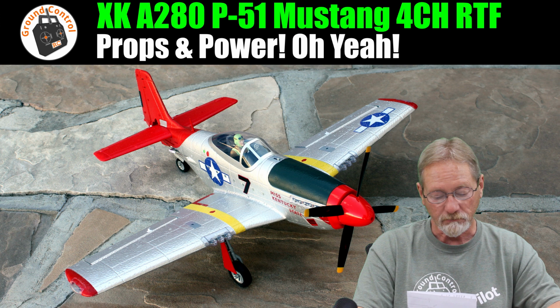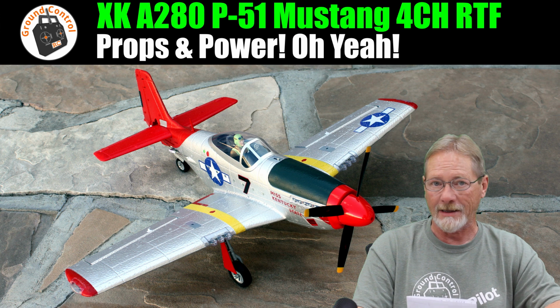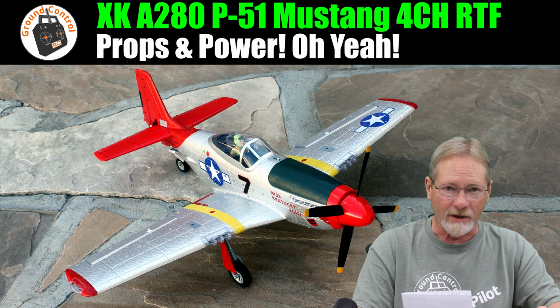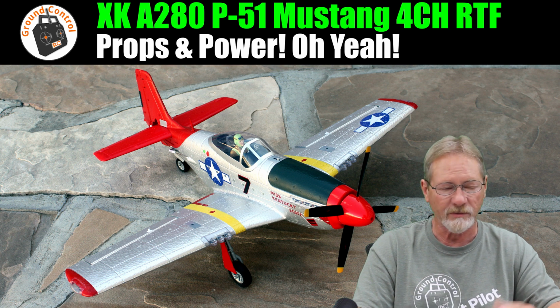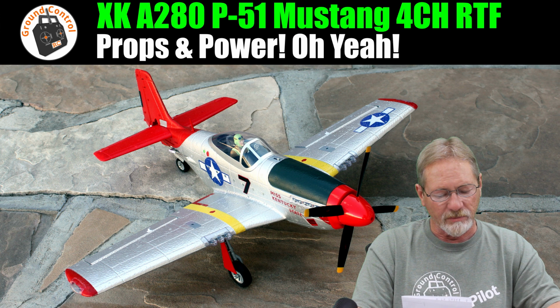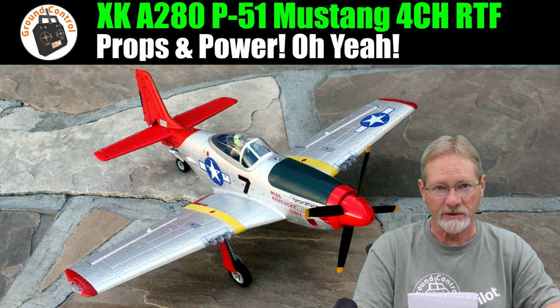I'm hoping, with the stock prop pulling 6.8 amps at full throttle, I wouldn't think that it would be a 7 amp ESC, because you're almost there at full throttle at the max amps of a 7 amp ESC, plus whatever its burst mode is for 3 or 4 seconds. But I would certainly think that with that stock prop pulling 6.8 amps, they'd put a 10 amp ESC in it. At least I hope that's what it is. I'm hoping I don't burn up the ESC during these test flights today.